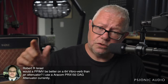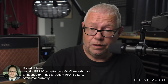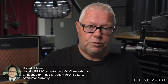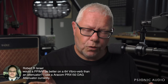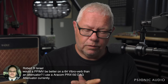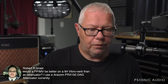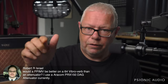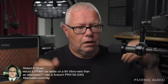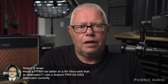That's why stereos used to have a loudness button. Maybe they still do. I haven't had a stereo in years, but that loudness button just boosts the highs and lows at lower volumes, which brings back kind of sort of the balance of highs to mids to lows you would hear if the volume on the amp was up higher. Of course, people being people, they would have the amp loud, the stereo loud, and then hit loudness as well and get a big bass boost and a big treble boost. Sound, man, what you gonna do?